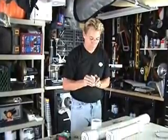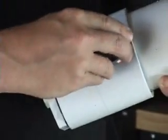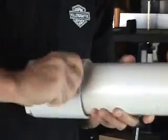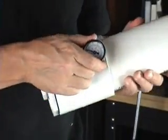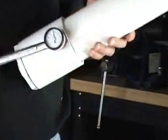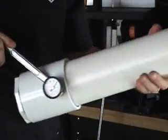Now we're going to pull out our pressure gauge, unpack it from its box. Go ahead and toss the box, you don't need it. What I'm going to do is hand thread this right into the hole we just drilled. You don't want to stress on this thing too much — when it starts feeling really tight with your hand, go ahead and switch to your 9/16th wrench and we're going to finish cranking it down. Just take your time and do it slowly so you don't cross-thread it. We don't want to strip it out because this has to be airtight.